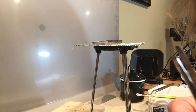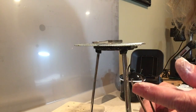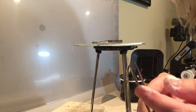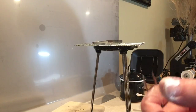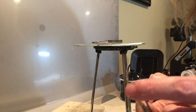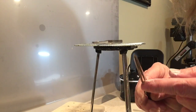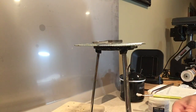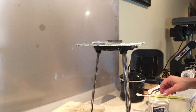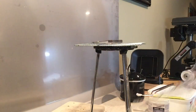And then on the tweezers, a tidbit: on the ends, right on this pair in particular, there are some serrated edges. You do not want to use that portion of them. If I go on down, it's very flat and flush, no serrated edges. You don't want to get the wire in the serrated edges, because when you heat that wire up, it's going to be so soft and then it's going to leave that imprint, so you don't want that. So make sure you have some interlocking tweezers that you can either go down further or do not have the serrated edges at all.